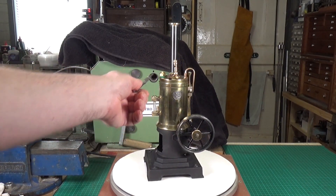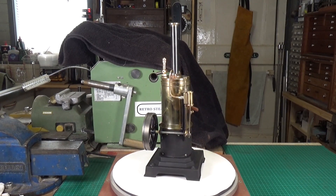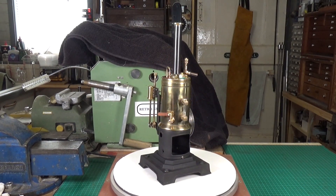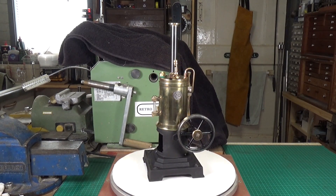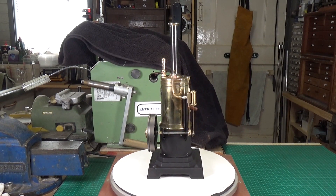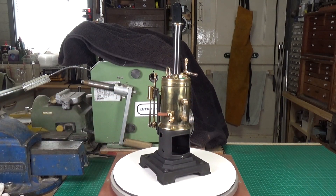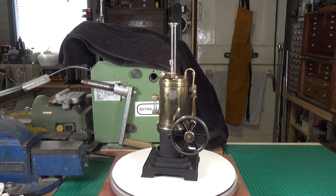The engine now has a safety valve — I copied pictures of safety valves for these vertical steam engines from the internet, and it appears to be working. I did run it on air, which I'll explain shortly. The only other thing I had to make was the handle on the boiler blowdown valve, which was almost completely missing. I've copied it as best I can — it's a little bit of mahogany turned up on the lathe, copied from the one on the whistle.